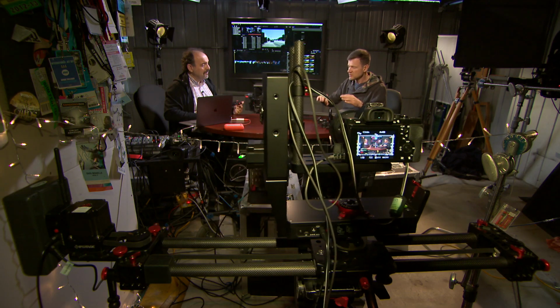That's how you set the length of the track, and that's important each time you add length to the track. I've been caught out before where if you have had it in the extended mode and then you put it back to this mode, and then the computer, I guess what it's doing, it counts the revolutions and keeps that as a memory. But you can cause all the cogs to sort of clash. I have a system myself: if you start hearing the cogs, you just pull the power out. I just say to the sound recordist or the producer, if I'm not here and it starts crunching, just pull that out, and that's the end of the story. That's a good safety. Yeah, because it's just there. Just pull it out.